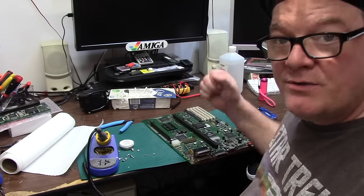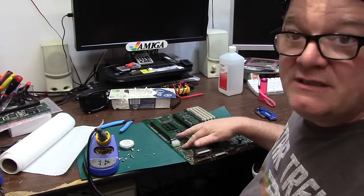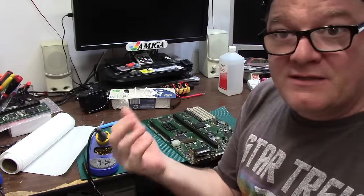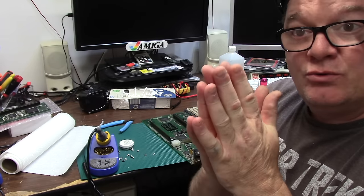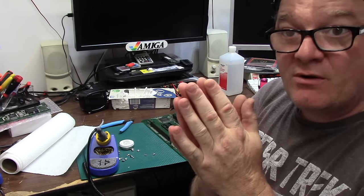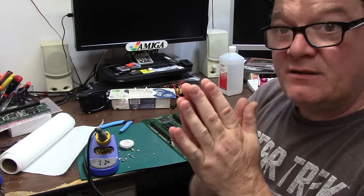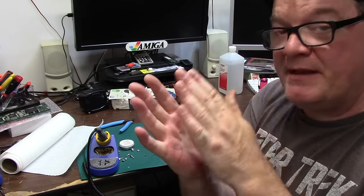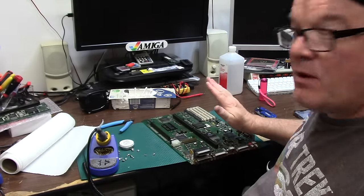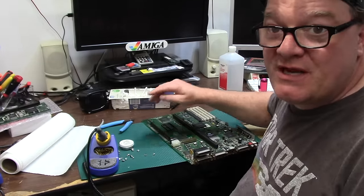If you are to use hot air, you can actually delaminate the epoxy from the layers. So a fiberglass circuit board has these circuit layers glued to it, and that's your traces and everything. They hold up very well. That epoxy's some strong stuff, but over the years it can lose its adhesion, and if you heat it up and get a wave forming, that wave can form a bubble underneath and separate a whole boatload of stuff.